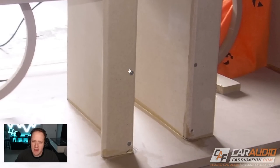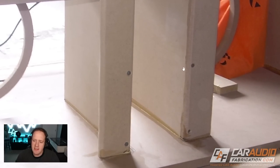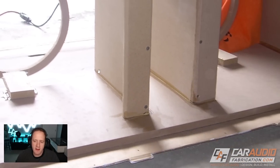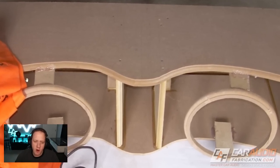Another thing I don't really like is using those screws to hold everything together. Really, you just need to clamp the different pieces of wood together and allow them to dry — you're going to get the most strength by using wood glue between the different pieces of material. They are a little close to where that round over needed to be, so I had to sink them in a little bit deeper than normal. What I would do nowadays is not even use the screws — I would rely on wood glue and a good clamping method. You can also see I used hot glue to hold these different pieces of the skeleton together, which is nice because you can adjust things while the glue is setting to make sure everything is symmetrical.